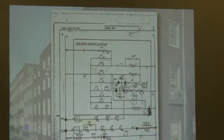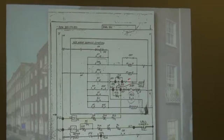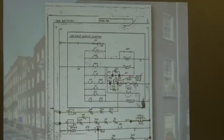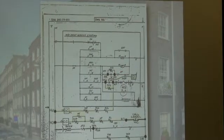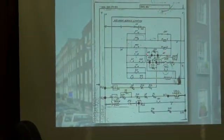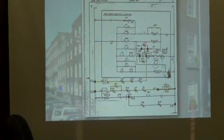Here's another good example of a circuit break. We want to break the NT resistor cap network, RC network, out of the NT relay. NT, in Otis's case, is their door time. We want to eliminate door time. So what we do is we simply take the cap out. Hello, no door time. But the way we do it is by breaking the circuit with an FS contact.